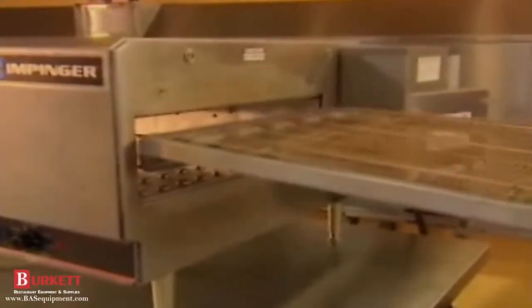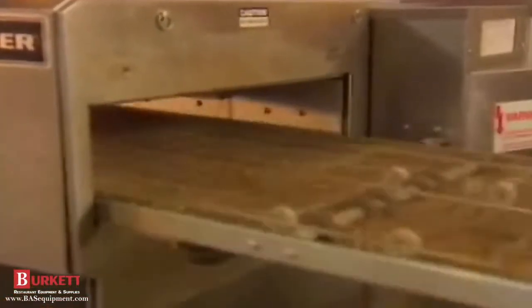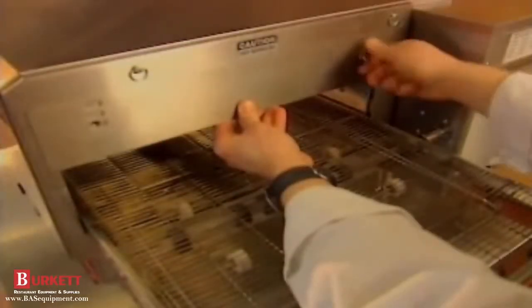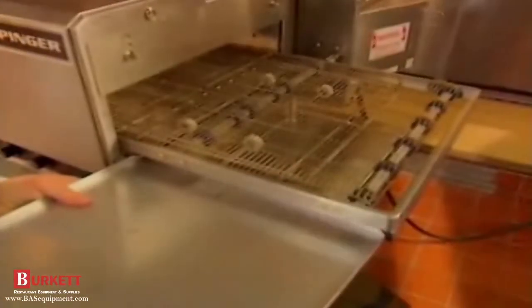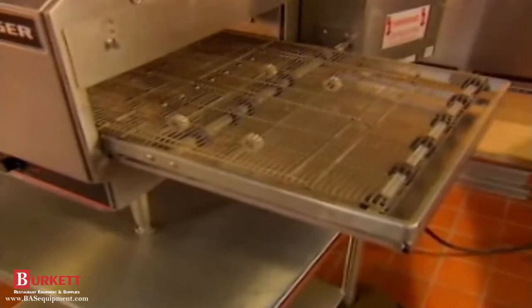When the conveyor is dry, hold the end with the drive connection up slightly and reinsert the conveyor in the oven. Now connect the drive sprocket. Reposition the end baffles over each oven cavity opening. Next, slide the crumb pans into the rails under the conveyor, for extended conveyors only, and install the optional conveyor takeoff shelf.